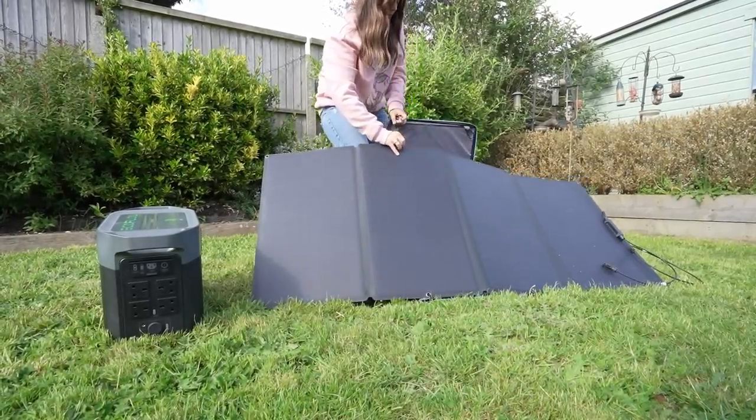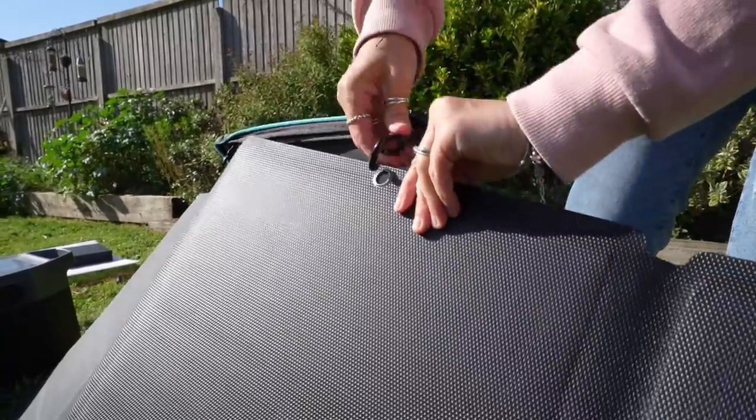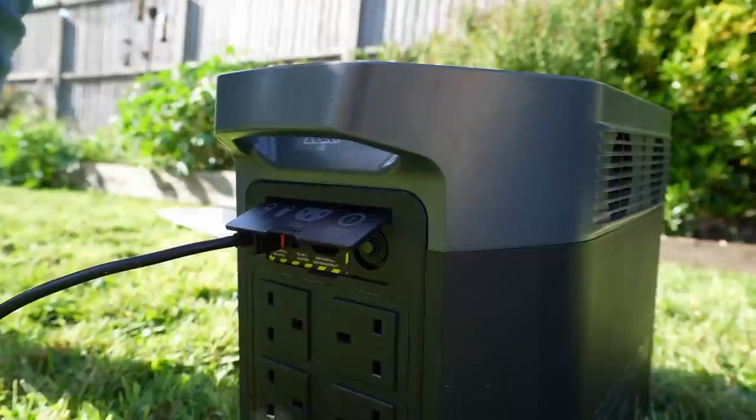When there's sun, you keep it topped up. When there's no sun, you've got the option of fast charging — zero to 80 percent in an hour. A friend of mine, Darren from The Urban Motorhome, actually took his to a store, had a coffee, sat there for an hour, plugged it in and charged it up. You can also pitch up at a campsite for a night and charge it there. You can charge this via 12 volt while driving too — my friend Matt did try it and said in about two hours of driving he put about 15 percent back in, which is higher than I expected. The EcoFlow solar panel they sent is a 130-watt panel, and we were getting 120 watts out of it — hugely efficient. By comparison, a cheap panel set up at the same time was outputting around 90 watts, so a massive difference.